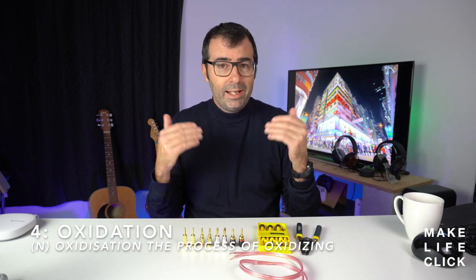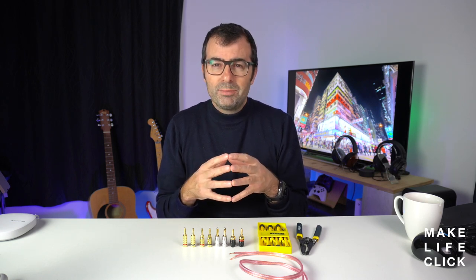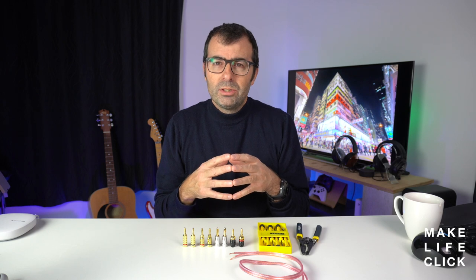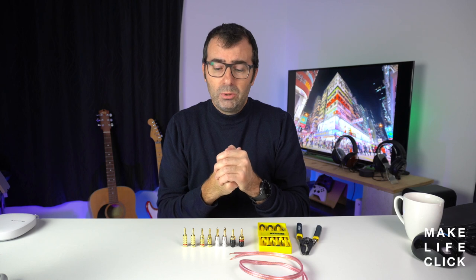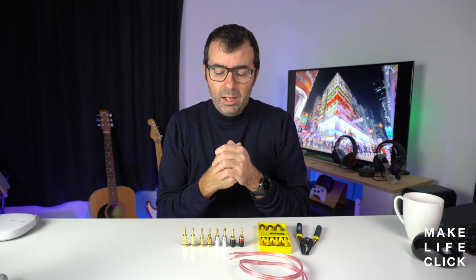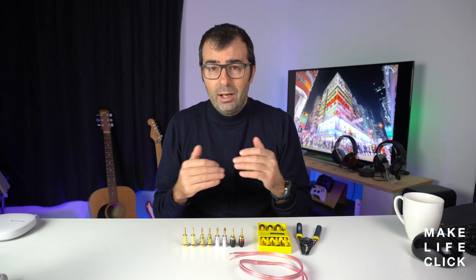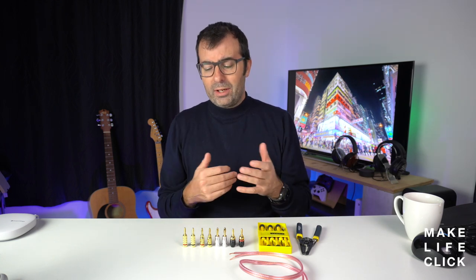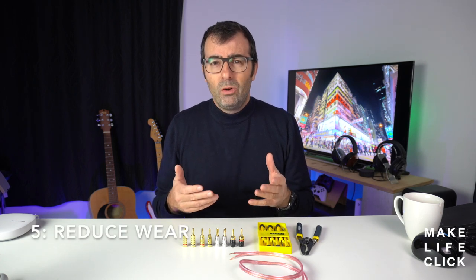Some people believe that the oils on your skin, if you're constantly touching the naked speaker wire, is not good for the wire. The challenge with speaker wire is really oxidization. What brands like Media Bridge, Sewell, and Austere are trying to do in part is reduce as much oxidization as possible - creating really good seals between wire and terminal inside the banana plug that will be less exposed to the risks of oxidization. They're not sealed completely airtight, but you've got a better chance with these. And one final thing they do is reduce the wear and tear on your units - it's just a lot easier and nicer to simply plug and unplug rather than constantly unscrewing binding posts.